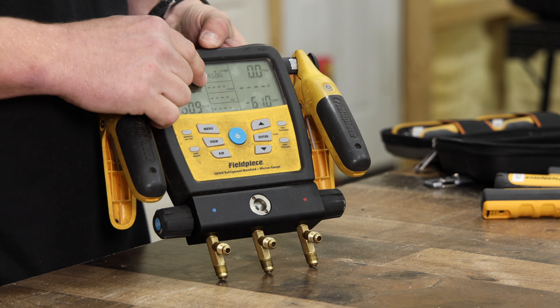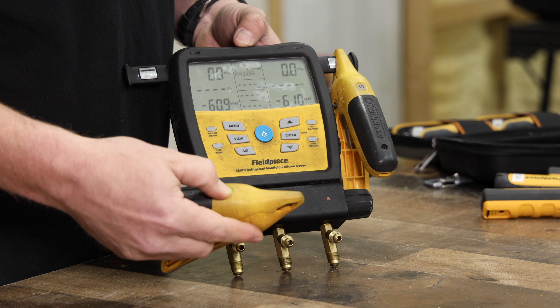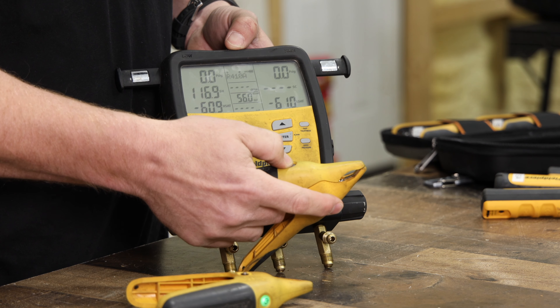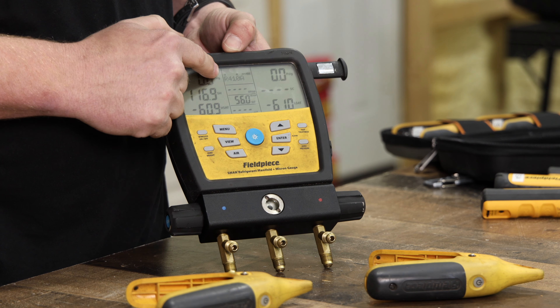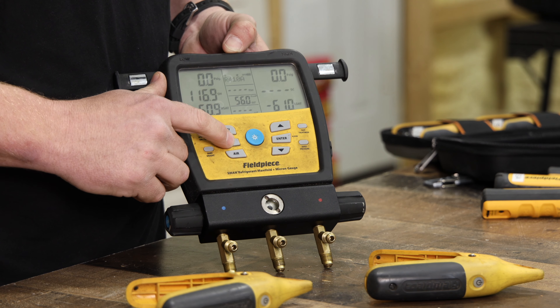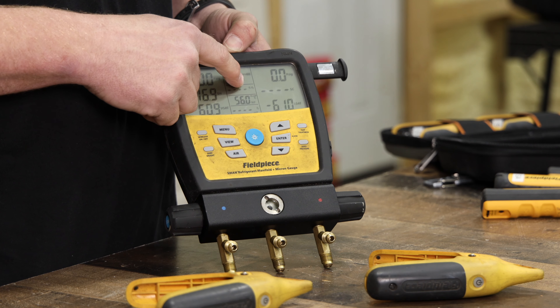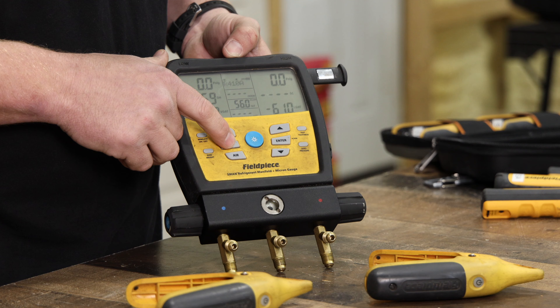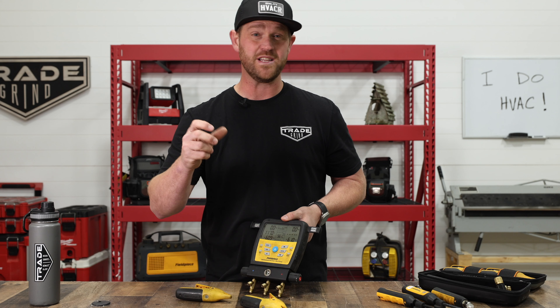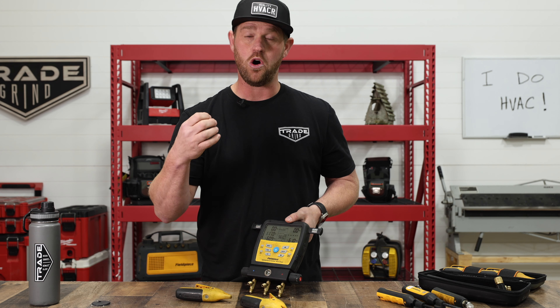Let's go through the view. Right now we're showing outdoor air temperature, suction line temp, and liquid line temp. If I were to turn these on, we'd actually get a number here. With actual pressure hooked up, it would give us our superheat and subcool right on this screen. Hitting view, we also have a target number, T1 and T2 for indoor return and supply temperature, then we cycle back through. You can read all the information you need while hooked up without running back inside — it's all live measurements.